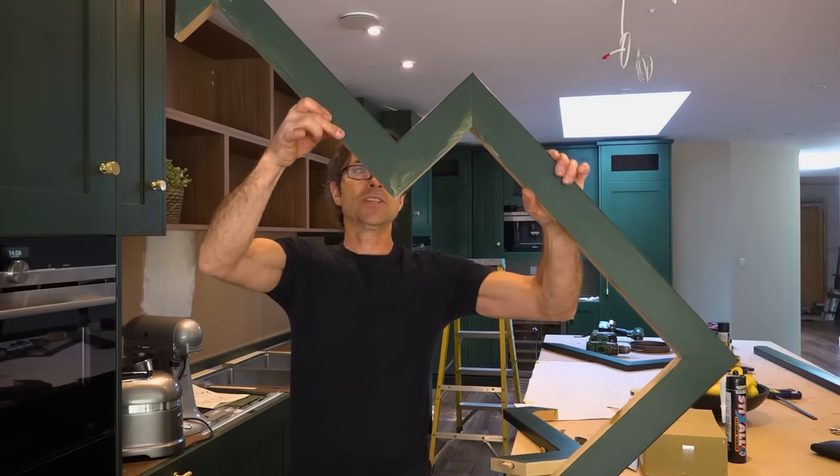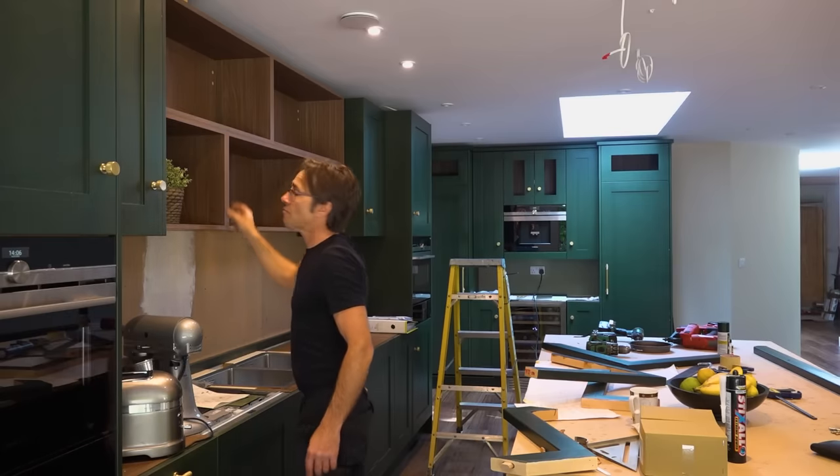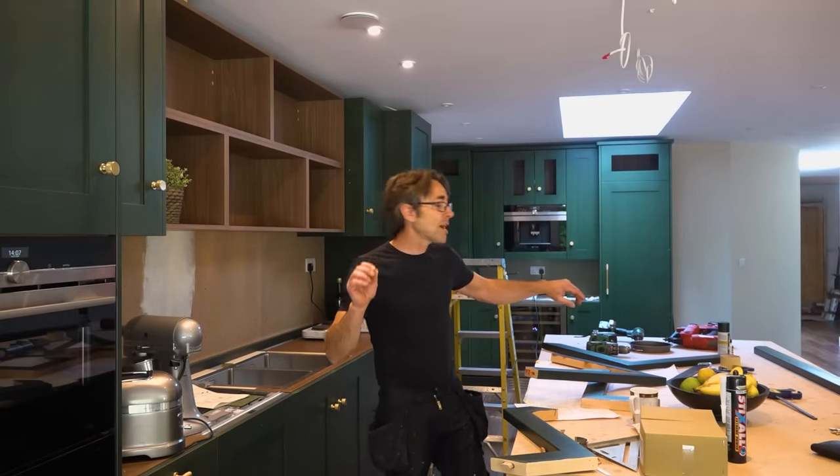You've got to love a domino. So that's one section there on this open shelving unit which is the Lincoln Walnut by Egger - beautiful stuff. I've got an MDF fascia front that I've made for that, again butted with dominoes - so it's mortised and tenoned effectively. I'm going to be fixing that up there with a combination of a polymer adhesive, something I use a lot more these days, and also 18 gauge brads, 50mm long - just enough to keep it all back and true, level and plumb, until the polymer goes off.